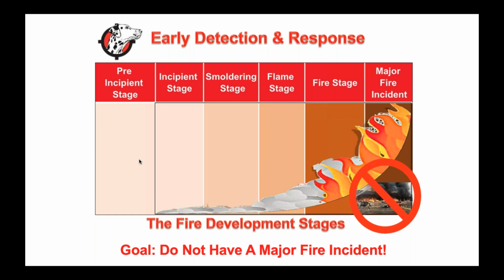As Andy had said before, when you're looking at it, I'm looking at thermal trends. I'm trying to understand, is there a rubber feedstock? Is there a deep-seated fire that's sitting in a rubber feedstock pile that I can catch today before it opens up and I have a 7-day fire and a massive fire that I'm dealing with? Or with ASR piles for scrap metal, where we're watching these and we're actually putting out hotspots and constantly doing it as part of the operation.